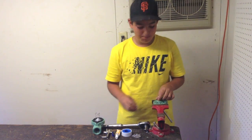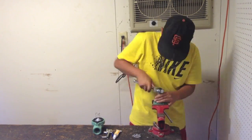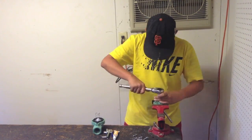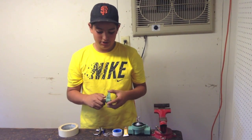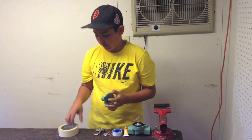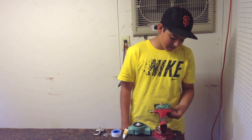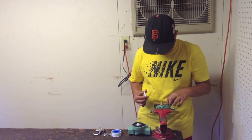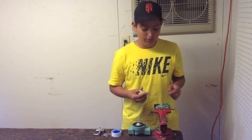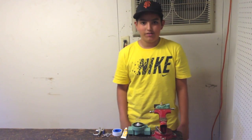Then you will insert it into the top of the sprinkler valve. Once you have inserted your half-inch nipple, you will then get a piece of masking tape and close off this stem. Once you have sealed the stem with masking tape, you will then get JB Weld and fill in the little leaks of air that can come through these small holes. Once the holes are filled with JB Weld, you will then put the sprinkler valve off to the side to let dry for at least 24 hours.